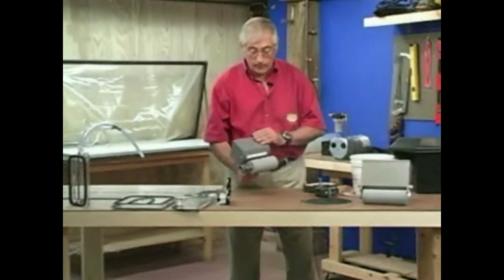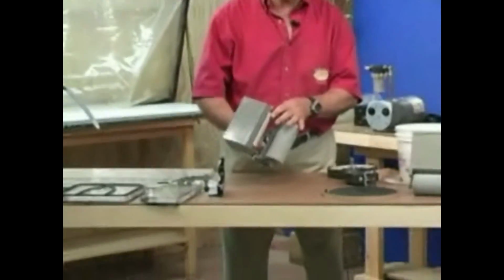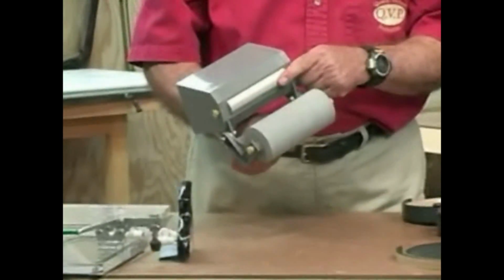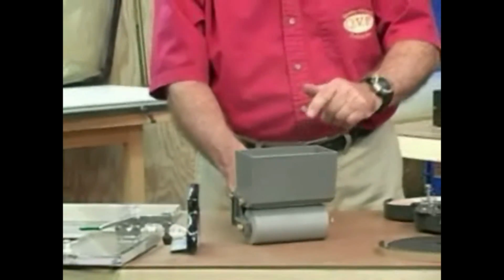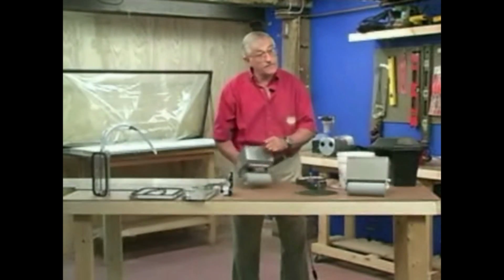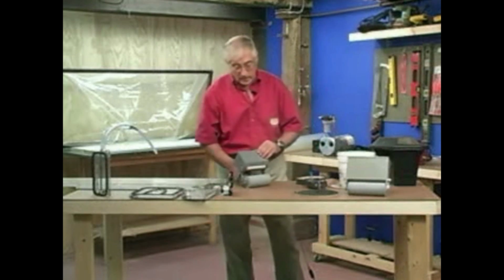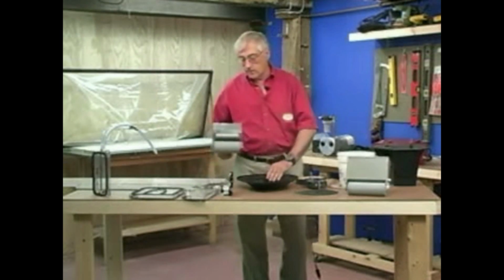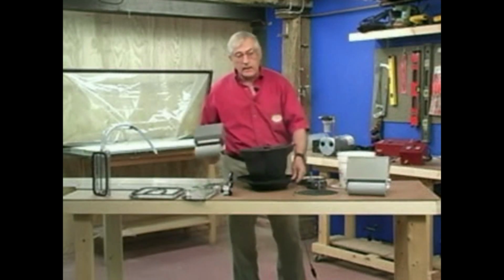They have a hinged roller that when you hinge it up against the hopper, it hits against what they call a doctor roller. This is an aluminum roller that's half in and half out of the hopper. When it's together and you're rolling it along, it brings the glue from inside outside on your roller and puts down a nice even layer. When you have enough down, if you just want to spread it, you just separate the hopper and spread it and roll it out.